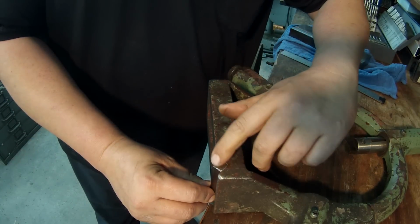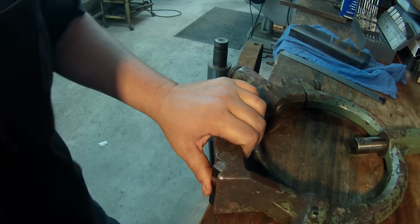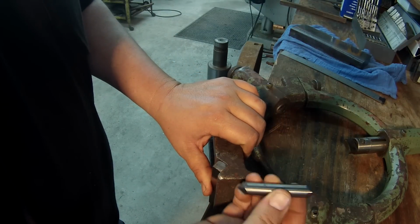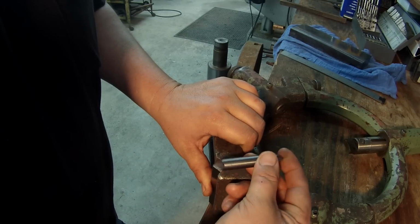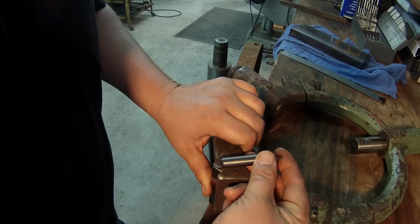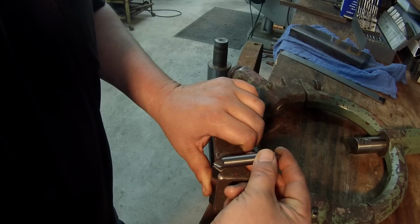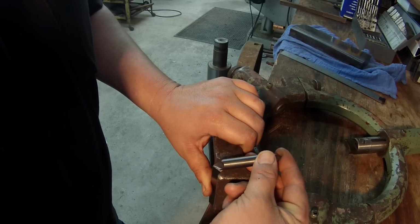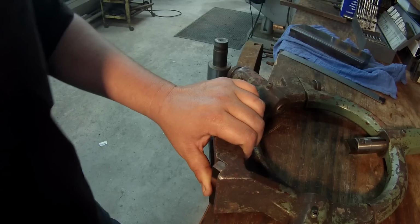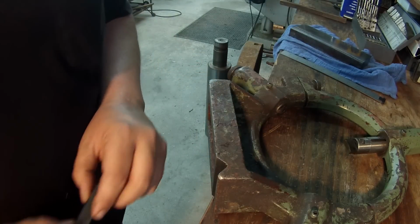So we'll have a little V that we're going to machine into our plate, and I've got this nice carbide angle mill here, and I'm hoping that's going to be enough to mill the slot needed in the plate there. I may have to end up working it back and forth to each side just a little bit to open it up to the right depth. All right, so there's our key, so let's go ahead and get onto the plate.